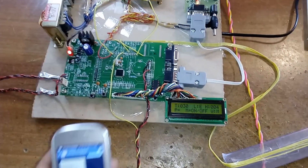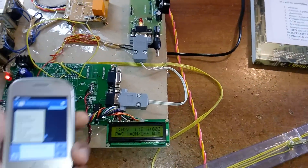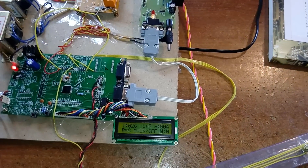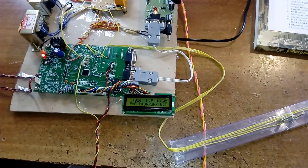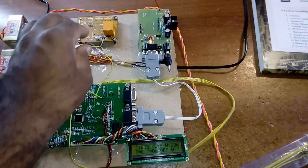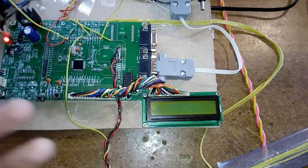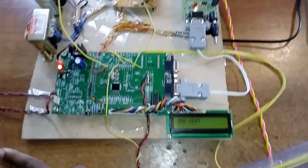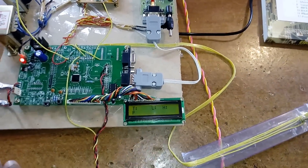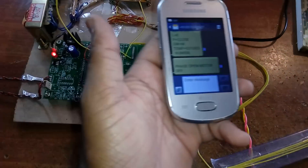The status SMS shows: motor off, water level empty — this needs to be filled — phase closed, groundwater medium, temperature 31 degrees, humidity 006. The owner can turn on the motor if needed. If the phase is open (P = open), the motor is off because water level is already empty and phase is open — no SMS is sent to the owner proactively, but the kit will report 'phase open, motor off' when queried.